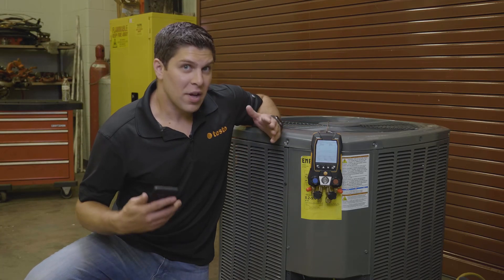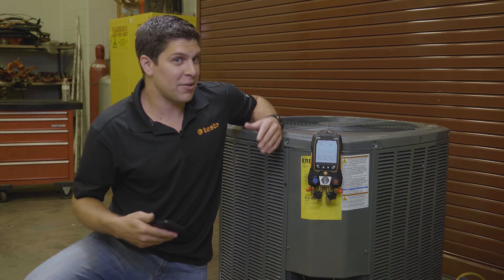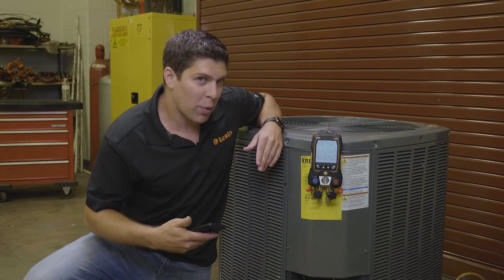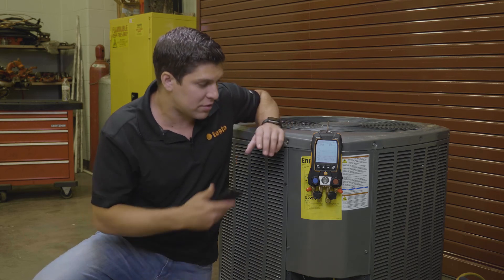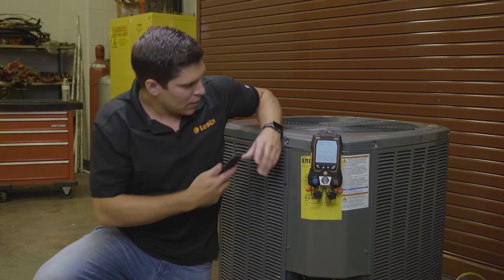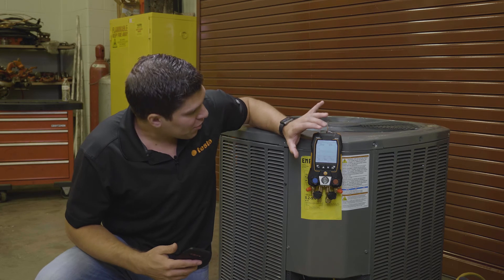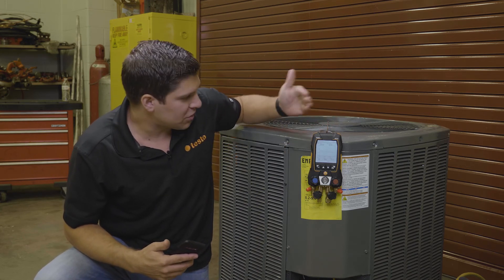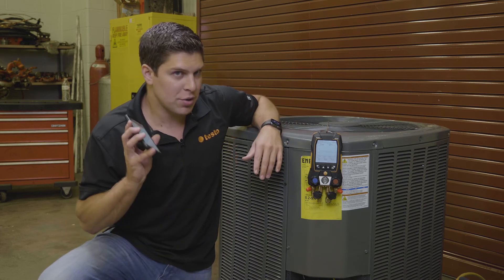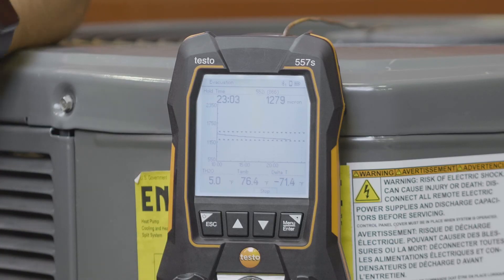All of us as techs know — depending on the vacuum pump, depending on your hoses — this took a little bit of time. It could take an hour, six hours, worst case could take a day. We've already adjusted the parameters to about 1,250 microns. I'm going to go ahead and close off our pump and shut it off. You're going to notice your microns are going to jump up a little bit. With the graphical display, you're able to see the sweep. Generally we want to wait another 10 minutes or so, but just for the sake of this demonstration, we're holding real tight. What you'll eventually see on the graph and the smart app is the sweep goes up a little bit, then it flattens out — that means we've got a successful vacuum at whatever target you want to set.